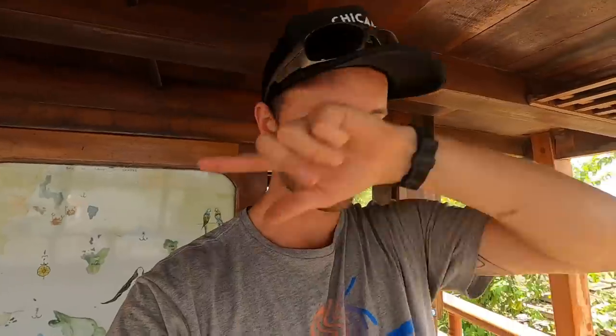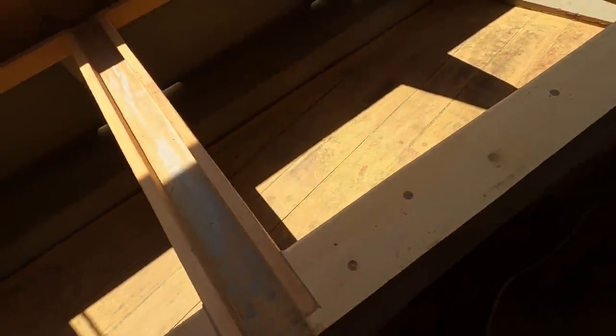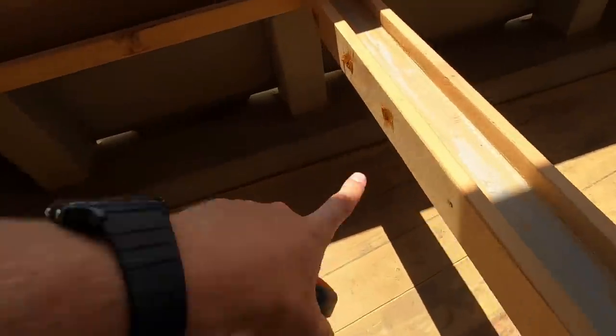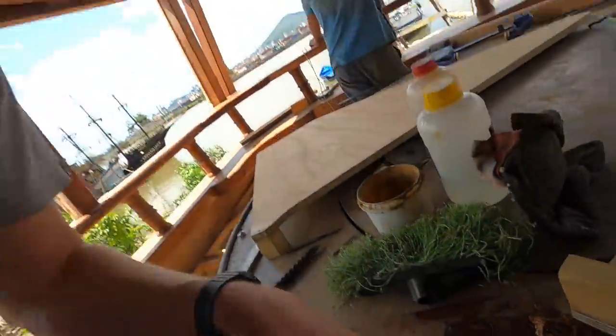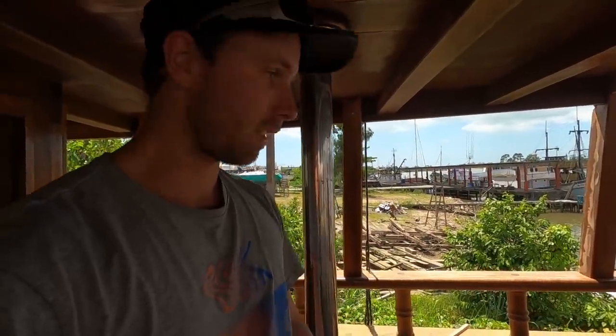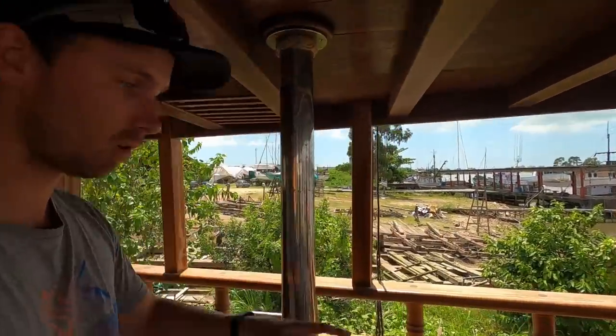We're going to put them all to the side so that then I can sand them nicely with a really low grit and varnish them with a PU varnish to keep them nice and protected from water, like literally all around, before we start even thinking of fastening them onto the hinges. And same for this, I've just been filling up, you see here, we have filled it with epoxy resin, but there's little dips in them, so I've been topping them up as well over here on the insides with the epoxy resin with sawdust. Now of course that's gonna have to dry and then sand that off, and then I can PU varnish all of that.